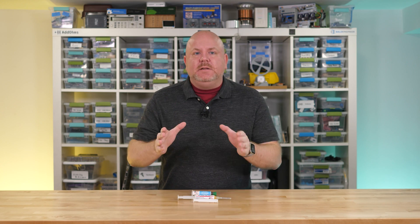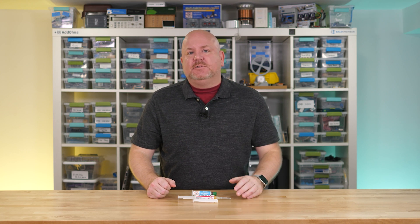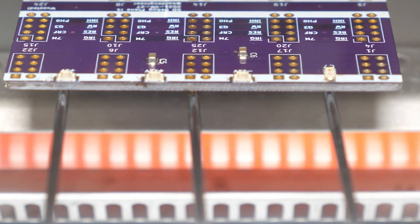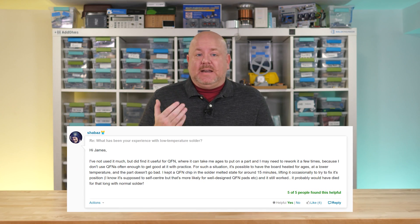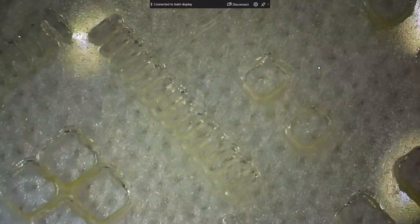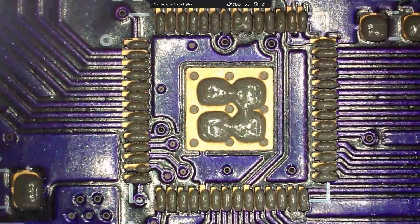Without any question, the low melting point makes working with bismuth solder much easier than either of the traditional alloys. Reflow ovens do not have to run as hot, and components — especially LEDs — are not subjected to extreme temperatures, so overall there's less stress. Based on some Element 14 community feedback, I tried out the MG paste on a QFN package. My part of choice is an RP2040, and even with these super cheap Mylar stencils, the T3 paste prints it with no problem.